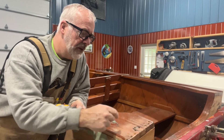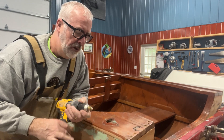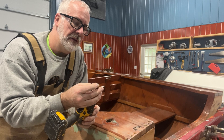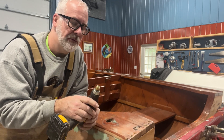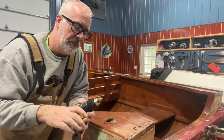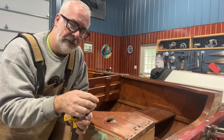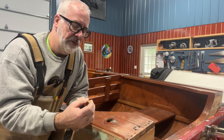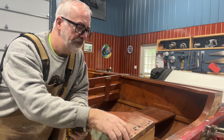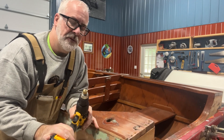Another way to make sure you have a clean circle when you start to dig it out with a pick is to use a regular countersink bit — not a fuller countersink bit, but just a regular countersink bit that somebody would use when doing cabinets. This has a sharp enough point that if you get it in the middle, maybe even make a small hole with the pick first, this will go down in there and do the same as the fuller, without the bit hitting the top of that screw. It will hit it and you'll feel it and you'll stop.